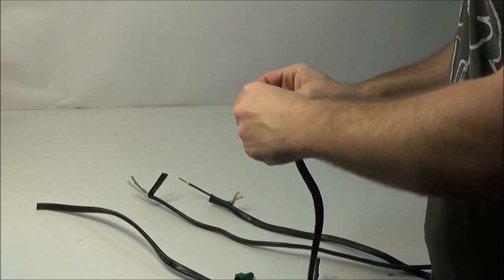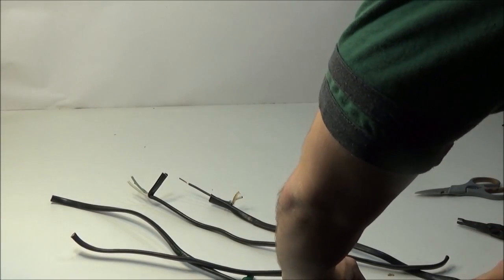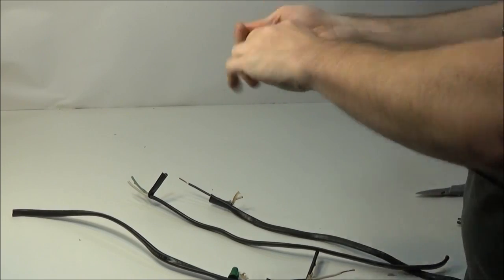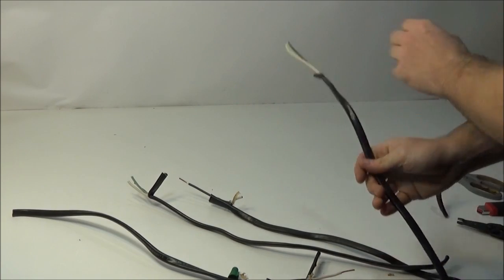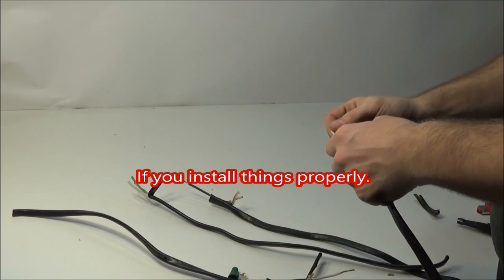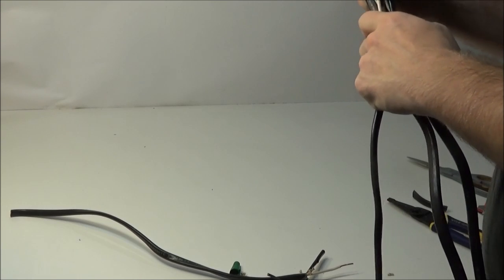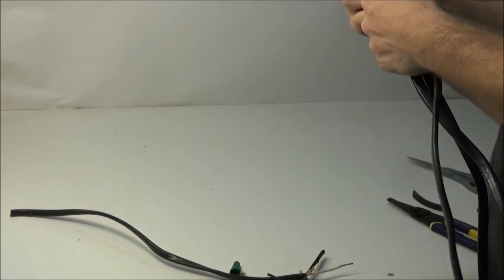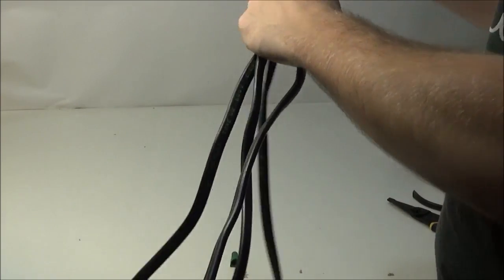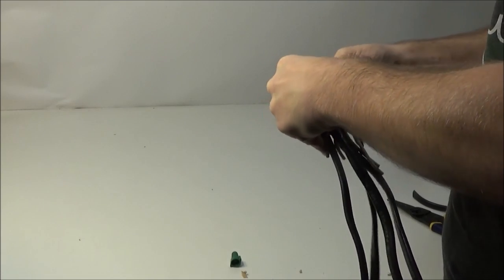While I'm doing this, I want to talk about people taping wire nuts. If you feel that you have to tape a wire nut, you don't have the right wire nut, or you're not sure of your work. And you should always be 100% sure of your work when you're working with electrical. Some people think it keeps it from coming loose, or it'll keep another wire from stabbing up inside of it — I don't think that's going to happen. I'm not an electrician, just a very anal DIY-er. I want people to call me out and provide facts, provide sources. Happy to learn.